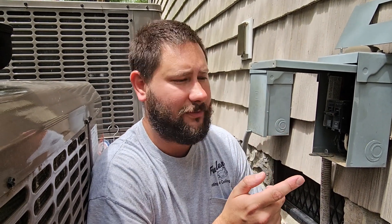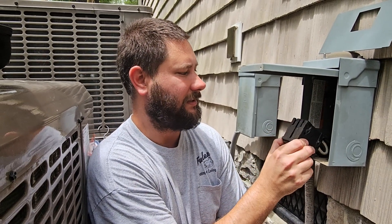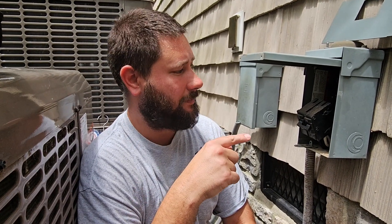Since I know it's not pulling more than 50 amps, I'm going to shut the breaker off. We're going to pull this breaker out — and the breaker is hot. I'm going to get my thermal imaging camera and we're going to read the temperature of that breaker because it's super hot. So we may have a loose connection or a bad breaker.